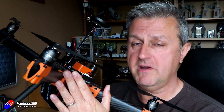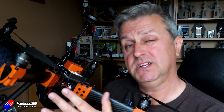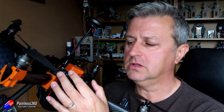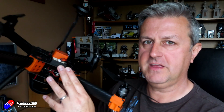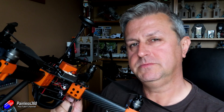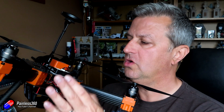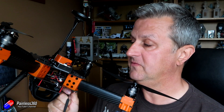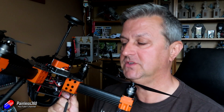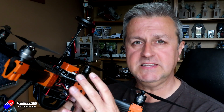It flew and it flew very well. That's because this is a reference frame — I've already loaded the tuning for it which is pretty close. If I hadn't had access to that tuning, I'd recommend going through an auto-tune cycle. I'll put links in the description below. Auto-tune will allow the Pixhawk and the ArduPilot technology to flick and roll it around and eventually get it a little bit closer — still not as good as a manual tune in my humble opinion, but very, very close. The big trick with a maiden flight is not to try too much and to make sure that before you add anything else like cameras, FPV, gimbals, or whatever it is you want to add, it works okay in this specific setup.